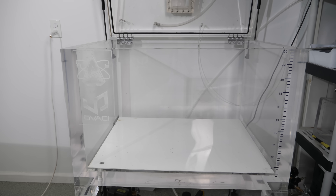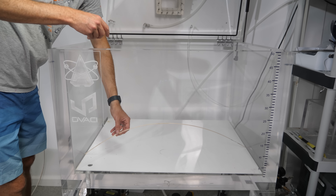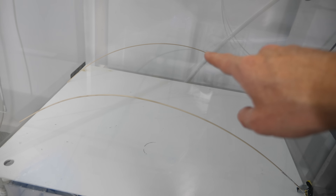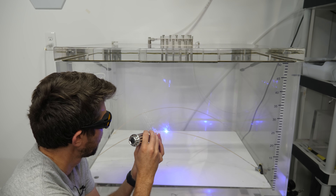So ultimately it was the heat that melted the lignin in the wood. Could we do the same thing by applying heat to a piece of wood and trying to shape it? When we create heat from friction, we aren't allowing oxygen to reach the bulk of the hot wood to react with it. So we would need a way to exclude oxygen while applying heat. The answer: the vacuum chamber. I'm going to take this piece of wood and bend it in here, and I'm going to heat my wood with a laser while it's under vacuum and see if I can permanently deform it due to melting the lignin.